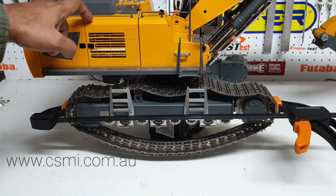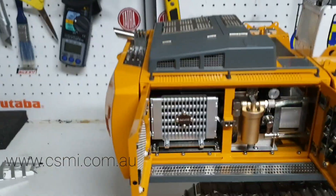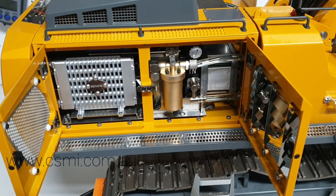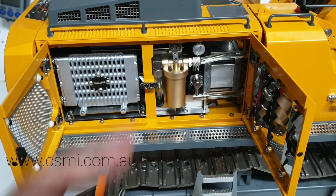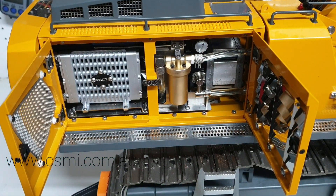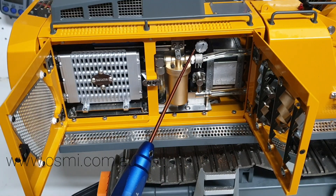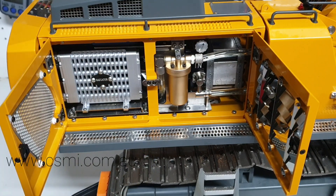So where was the oil leaking from? I'll get the camera a bit closer so you can see. There's a pressure regulating valve over here, and there's an O-ring around it. Because it's got threads, the O-ring behind the threads prevents the oil from leaking. The original O-ring was about 1mm diameter - I've gone for a 1.5mm one and it seems to have stopped the leak, so the oil was coming out from there.